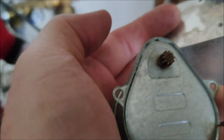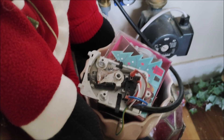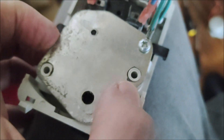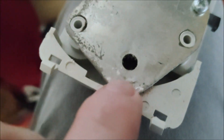When you put the back plate on, make sure your teeth mesh correctly. You might need to move the lever slightly to get it into place but it's fairly straightforward. Now it's about the reassembly. This cover plate locates with those two dowels — there and there — and that's the aperture for the motor to go through.